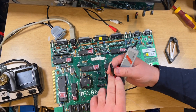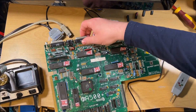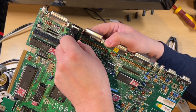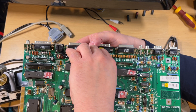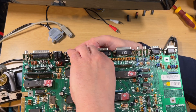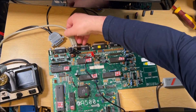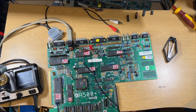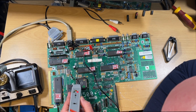At this point I decided to try a logic probe - I've never used one before, but going forward this is a great little device. What you need to do is connect it to zero volts off the socket, and on the 500 this first pin on the keyboard gives a good 5 volts. All you do is power the board up, then you can just dab it on each one of the chips and see what data you're getting. You're not going to make much sense of it because it's either going to go high - ones or zeros. You can see they're all ones, and the flashing one means there's data coming backwards and forwards.